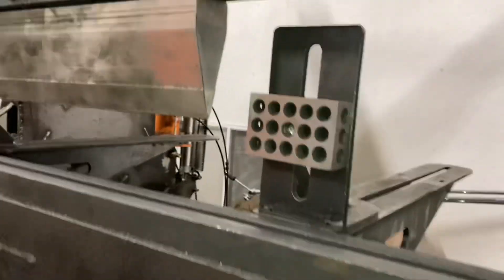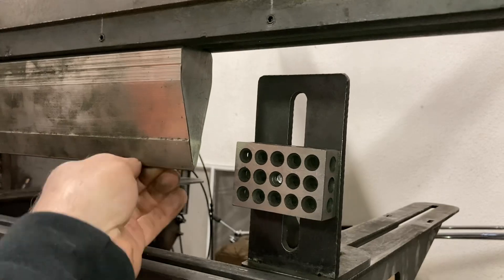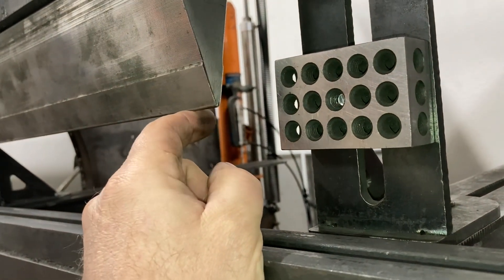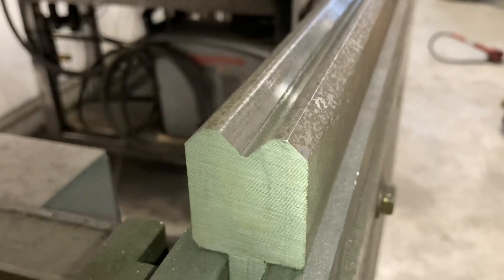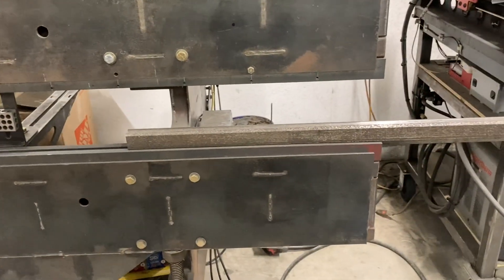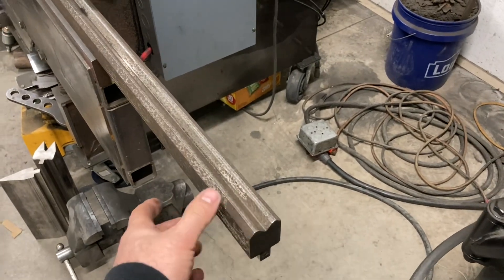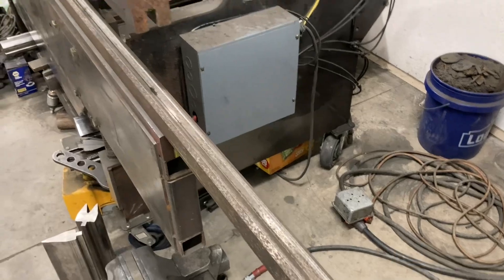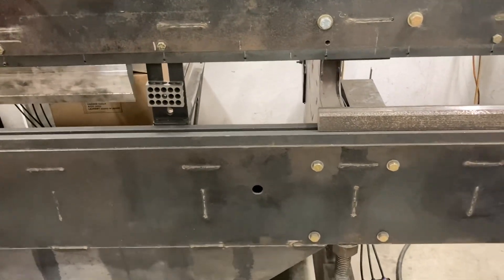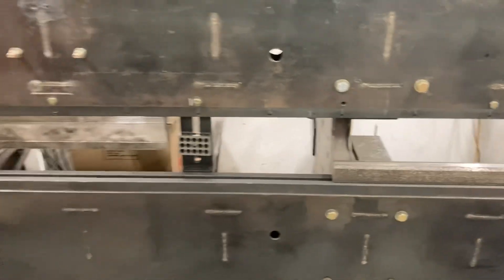I'm just bending a piece of 20 gauge — it's a pretty accurate channel. I basically only have one set of top punches right now, which is kind of a bummer. This is a 78 thousandths radius — a little bigger than what I really need for that sheet metal, but it's fine. The bottom die will be this three quarter inch bottom that I've got. The hard part with having a press brake is you burn up so much money in tooling. Luckily with the majority of stuff I do, between sheet metal and three sixteenths, that's really my main bread and butter. Occasionally when I need to do something crazy, I'll just make a die.